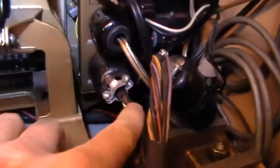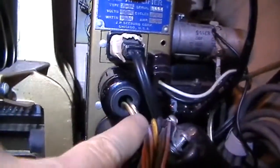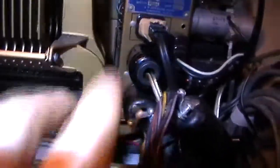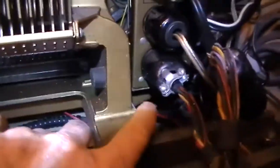What I'm going to have to do is a modification because with the plug sticking straight out it's going to hit because there's no clearance. I've got the cap that went to this thing — I put this in for my switches shown in an earlier video — I've got the top cap, and I'm going to cut a hole through the side of it so that this plug angles down like the original plug over here does. That way this thing won't run into it.